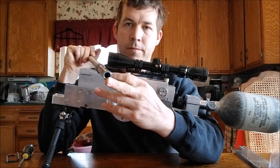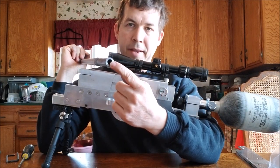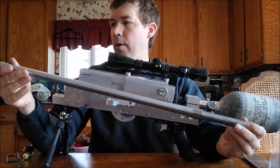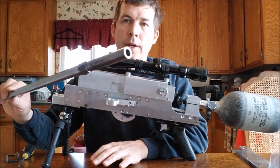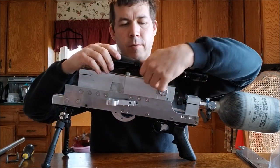This is a black powder barrel, so I cut the end off and turned out the inside so I have a spot to seat the bullet — slightly bigger than the bullet diameter — so I'm not trying to shove the bullet into the rifling by hand, which would be very difficult. That's the barrel broken down. I can change out the barrel to basically any size I want, so long as I have this three-quarter-inch piece on the back.